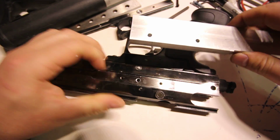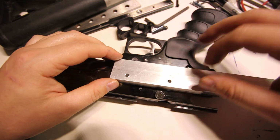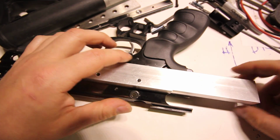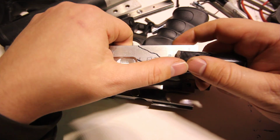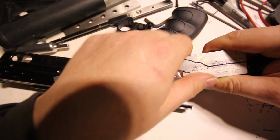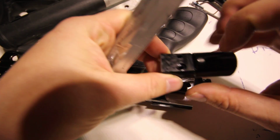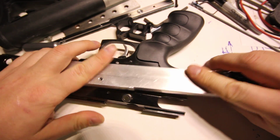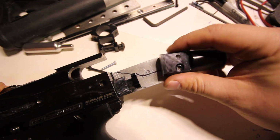The idea was to have this metal rail here, this isn't finished obviously, and have the air go inside this metal bar until it gets to the back, and then here I'll have an ASA with the pocket hole like this and an O-ring, and it'll interface into another hole here, and this hole will be bored, and there will be another channel bored from here into this chamber, and the hole will be plugged up with a set screw. So basically something like that, and this will sit in the gun, and then the bottle will be right here